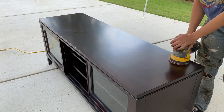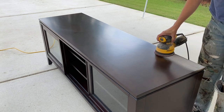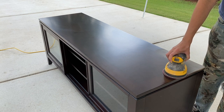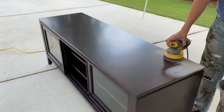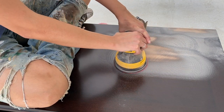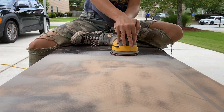I'm showing you this in real time so you guys can hear and watch how I'm sanding. I want you to listen to where my pressure is — I'm not putting too much pressure so the sander gets that low rumble, I'm just putting enough to let it do its thing. I'm also showing you how slow I'm going because the slower you go the less likely you are to get those squiggly lines. I found it was actual veneer as I sanded, and look how beautiful it is. For my sandpaper I'm using a reusable sanding pad — I'll include it in the description below — they are amazing and work so much better than your average sanding pad.